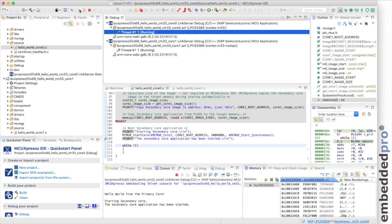That's this simple SDK example for the multi-core manager. Core 0 started up, initialized the multi-core manager, and started core 1 with startup data value 2,000,000. It waited until core 1 had received that data before continuing into the while loop. Core 1 received the startup data and uses the passed value to toggle the LED at a controllable rate.